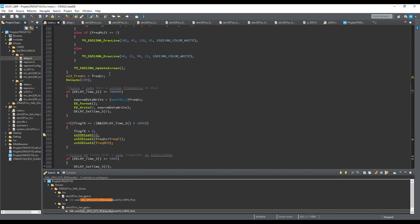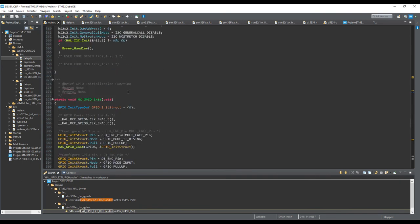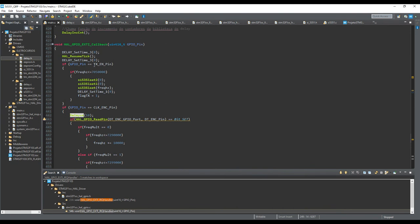Good. To finish this part here, we also have the transmission. Every time you are transmitting, you are sending information to an external interrupt pin. This external interrupt pin is actually the TX enable pin. You are coming to this part of the project. If your frequency is lower than 7 megahertz 50 kilohertz, okay, so you have a range between 7 megahertz and 7 megahertz 50 kilohertz